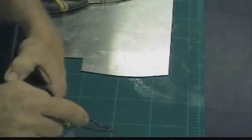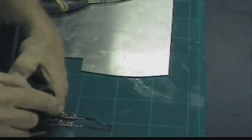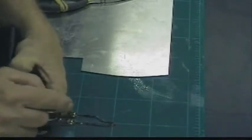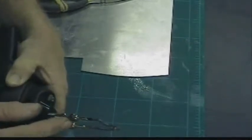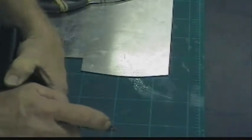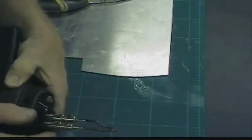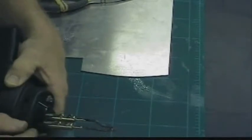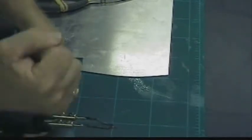It comes with a couple of different tips, going with the screws. If you buy one of these, make sure the screws are tight. If the screws aren't tight, the electricity won't flow with sufficient amperage to heat up the tip, and you'll be frustrated. So if your tip's not getting hot, tighten the screws.